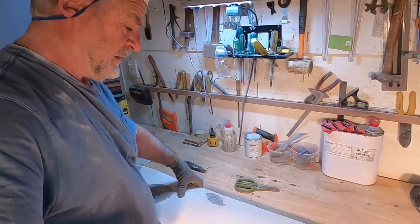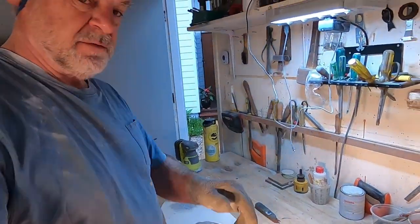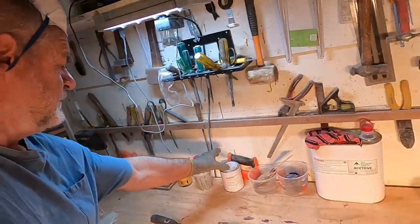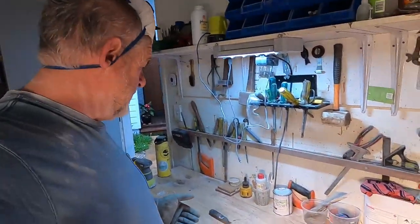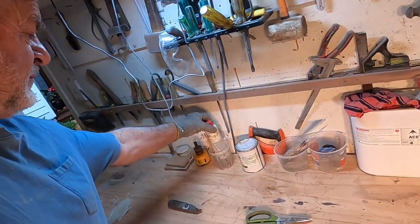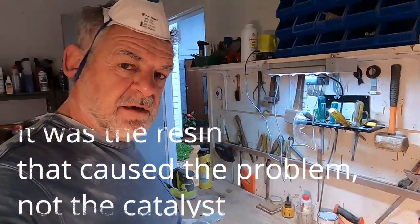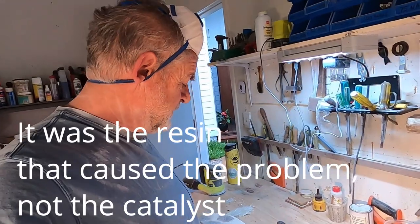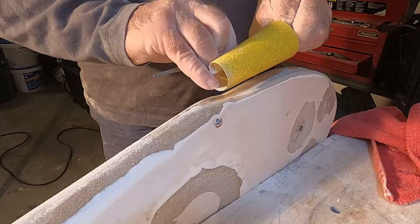I had to put some microbeads over the surface. The reason is I used some old polyester resin — not old really, about a year old — and some MEKP that might be a little bit older. I don't know which of the two, but it does have a shelf life and it's beyond its shelf life, and consequently it didn't go off properly.